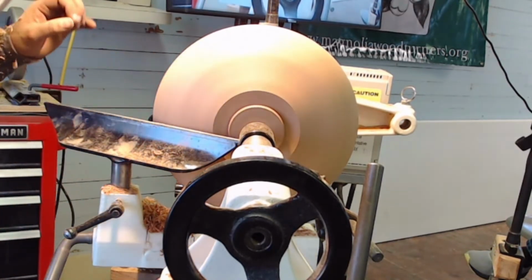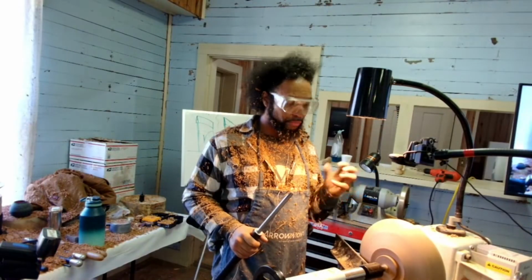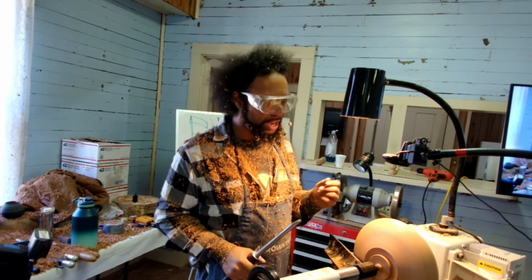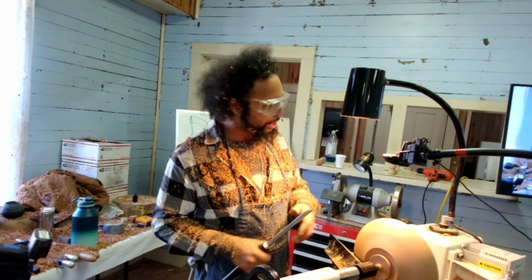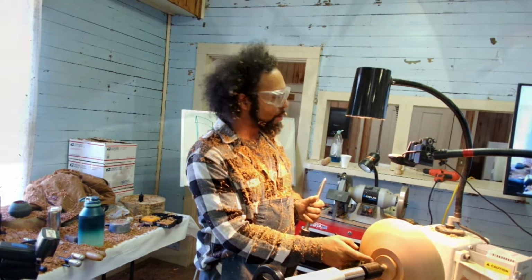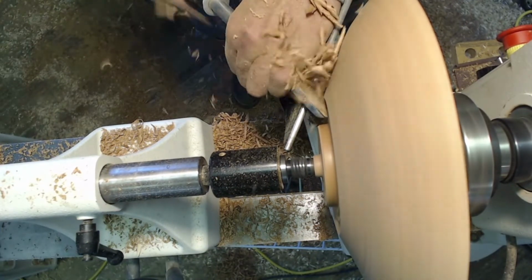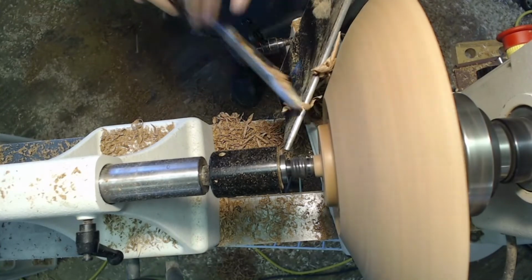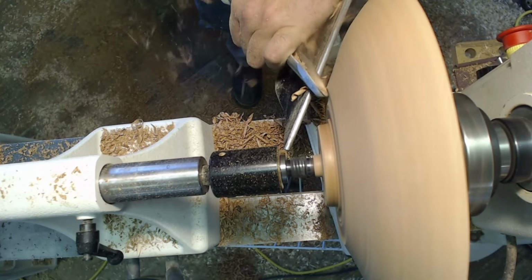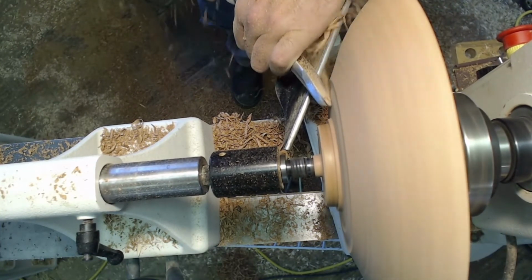And I wouldn't go by a specific number or length. I just go by the width of the face of your jaws. So the face of these jaws are probably about 1/4 of an inch, maybe close to that. That means you really don't need much of the flat portion of those jaws to abut against the shoulder. All I found is that you need about 1/8 of an inch. So here, there, maybe right there, and that'll be a good margin for where I'm at. Good metric. So now I'll go ahead and true this up.